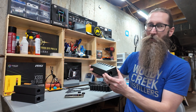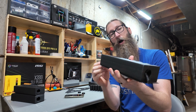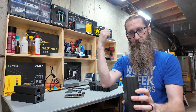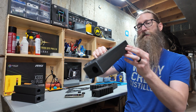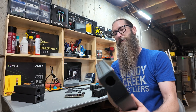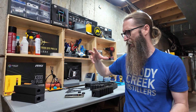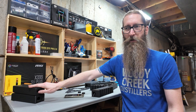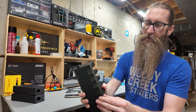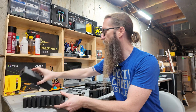What I ended up doing was using tree supports but with a five millimeter diameter. If you look in here, that's tree supports all the way down — they're hollow, so there's a bunch of circles all the way down as support. You can literally take a screwdriver, snap each side, and the whole thing comes right off nice and clean. There's just a little bit of leftover. What I did was make the hole just a little bit bigger in diameter and it fits perfectly. It's hard getting a perfect diameter circle on stuff like this — I think it's because of the weight and heat as it's printing it kind of squishes even with supports. I also had to throw on brims because some of this was picking up off the print bed.